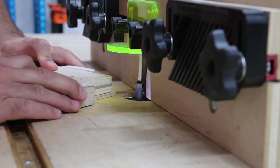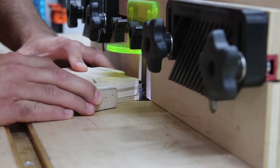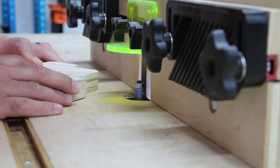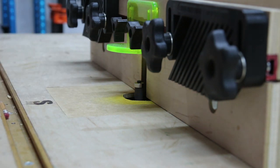I left about a quarter of an inch overhang on each of those templates. That overhang allows you to hook the corner of a square piece of stock without using any tape or anything. You'll also notice there's a hole on each of the templates for added security — when you're holding the templates while routing, it just feels better.